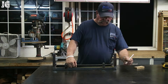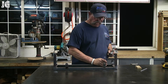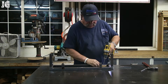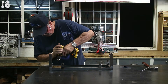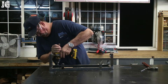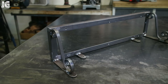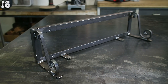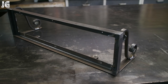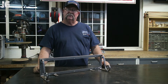We're right near the end of the project. I've flipped it upside down and I'm just drilling the six holes into the back of the bottom of the frame using a 3/16 drill bit. We measured everything out and used a center punch first. This metal is fairly soft so it drills really well with a brand new sharp drill bit. Then I backed that up with a countersink bit so the screws fit flush to the back of the metal with nothing sticking up.